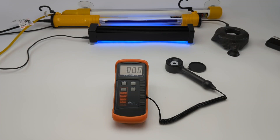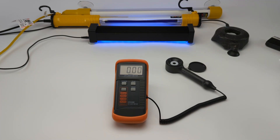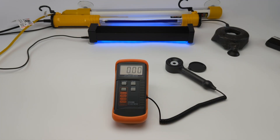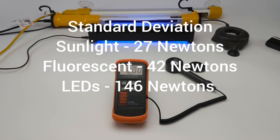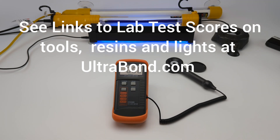Now let me show you the opposite of uniform energy curing. LEDs do not contain a filament — instead they illuminate using a semiconductor. So instead of instantly burning out like fluorescent bulbs, this is what's called lumen degradation or LED degradation. LED is becoming increasingly popular, but there's a misconception: many believe LED lights work the same until they go out, but in reality LED lighting slowly loses its brightness. Unlike fluorescent lamps that completely fail — making it easy to tell when a light needs replacing — LEDs don't go out completely, so you're left to people's perceptions.